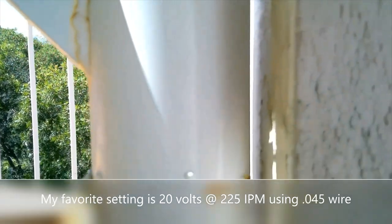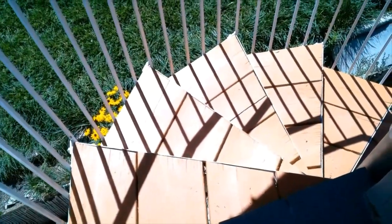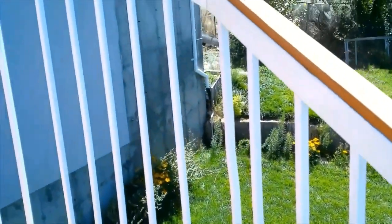I'm not a professional welder but I do work with good welders, and I think I did a pretty good job on most of my welds. I used a MIG welder with what I think was .045 wire. One thing I did was weld an extra section of pipe to my welding table, and as I welded each section I stacked them on top of each other to make sure everything would fit one inside the other. So when it came time to assemble the stairway I knew everything would fit, because they fit just fine on my welding table two at a time.